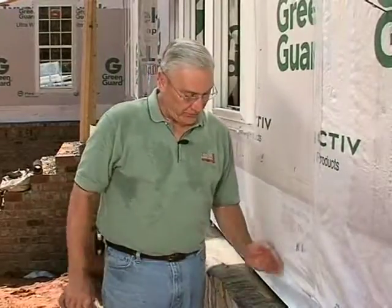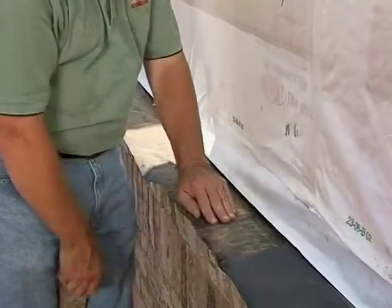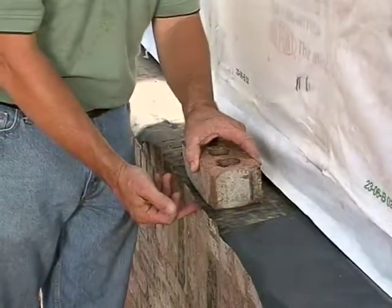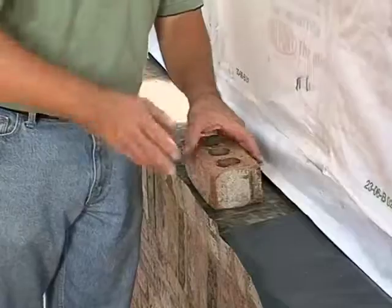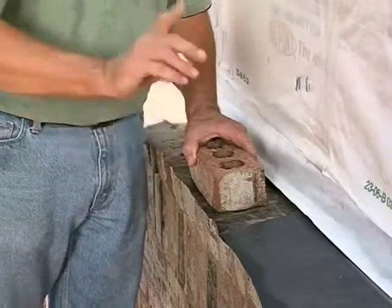Just one or two more things to you contractors before we start actually laying a brick. I want to talk about this base flashing and what I've heard sometimes from masons. Maybe you've heard the same from yours. The fear is this, that with this through wall flashing coming entirely through the wall, there might be a bond break. That when this brick is laid on top of this, it's not in any way bonded to the one beneath it. And they feel like that somehow this might rotate itself right off the house. That's not going to happen.